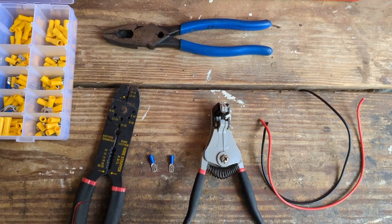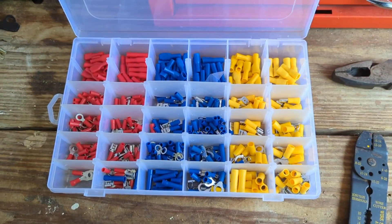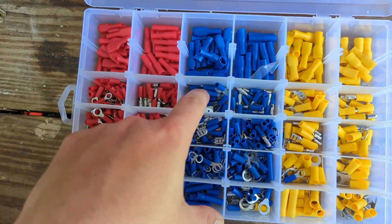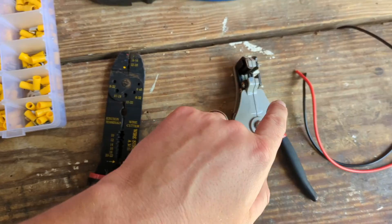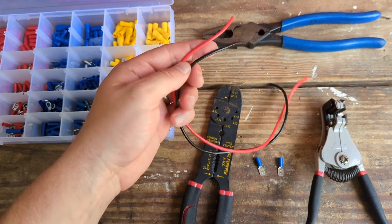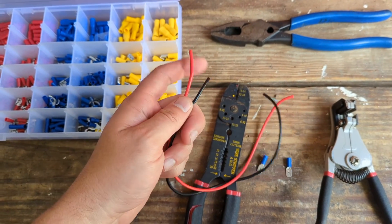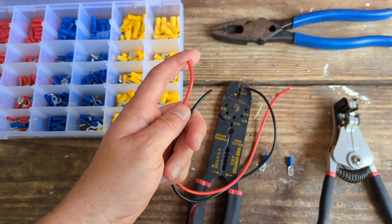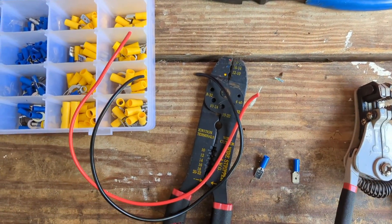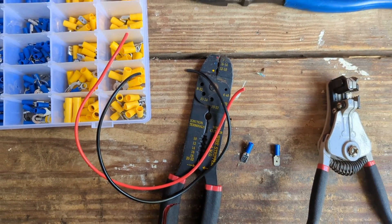Here's a quick rundown of the extra wiring that we're going to be adding. If you buy the kit of connectors that I recommend, you're going to pull two of the flat spades. We're going to put that on one end each of the wire. Cut a little bit extra so you have flexibility on where to put the 18-volt battery or whatever you choose to use. Two of these ends will have the spades. The other two we're going to strip about an inch of copper wire so that we can military splice into the existing wiring of the Hot Wheels.